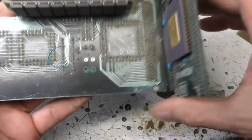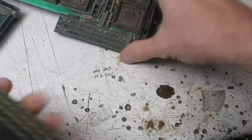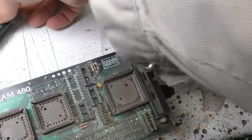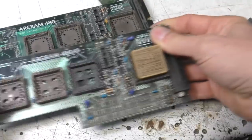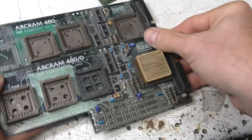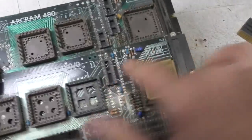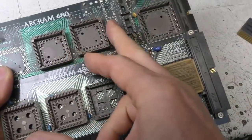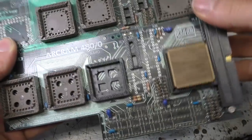So this one was for the 300 series, so this was basically 4 meg RAM plus ARM3, and this was for the 400 series, which is 8 meg RAM. There's actually two of these because at some point Acorn did a slight board revision on the 400 machines, so the only difference between these is about a 5mm difference between the positioning of these sockets, so we had to do another board just moving these around a bit so they'll actually plug in.